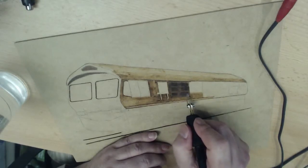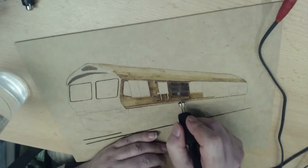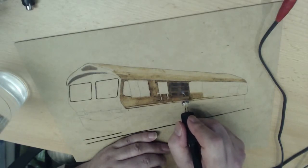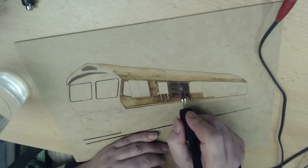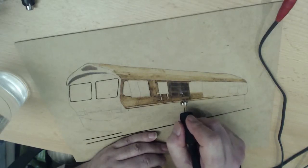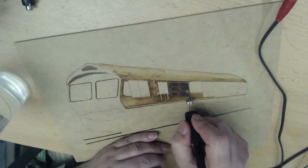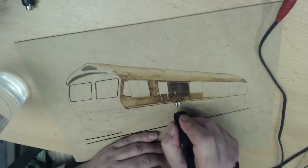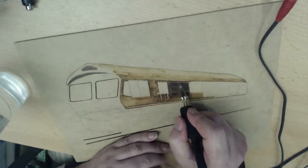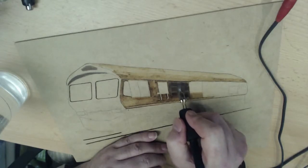which is what changes the colour, and then it sits on the surface providing that colour, almost like a varnish actually. And sometimes you can actually move that around with a little bit of heat, because it's liquid when it's warm. And so by just heating it up and performing a swirling action here, you can ease out any particularly dark patches sometimes, and smooth out the graduations of the shading and remove dark spots.